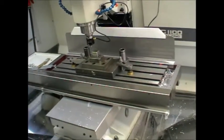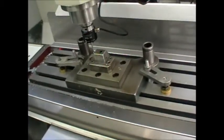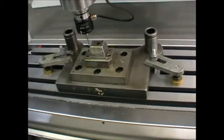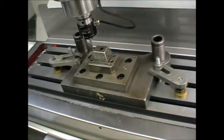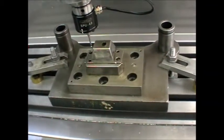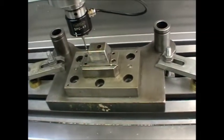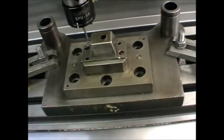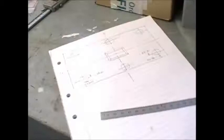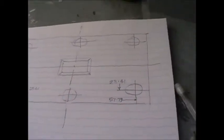The reason I bought the probe and Path Pilot was specifically for this type of job where I've got an old tool, an old press tool. It's probably been made a long time ago, perhaps even before the days of digital readout, and the holes and positions are probably slightly out — made via the center punch and drill press. So I want to know the hole centers relative to the punch so I can depict them on a drawing showing the XY coordinates.